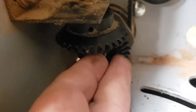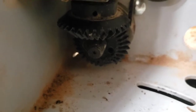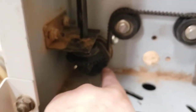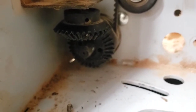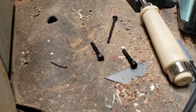I can spin them freely by hand because I've already started taking this thing apart. I figured I'd start up a video since I didn't see anything about this on YouTube yet. The way to fix this is to replace these two miter gears — this guy and this guy. They're actually both the same pitch, the same kind of gear, with a couple of slight differences in the way they mount. The one that mounts to the bottom of the post that raises the table mounts with these two 4mm Allen screws.